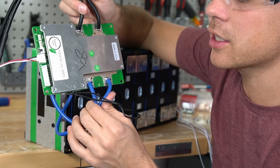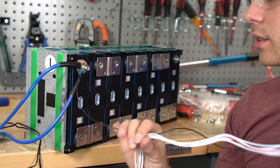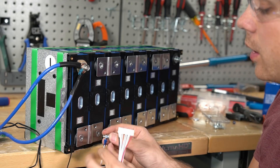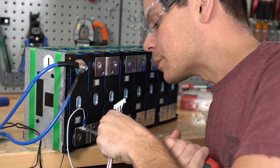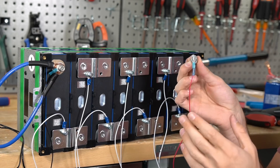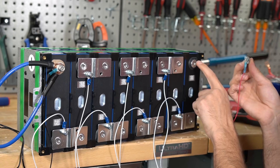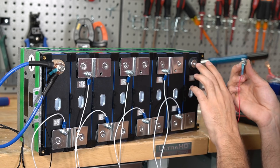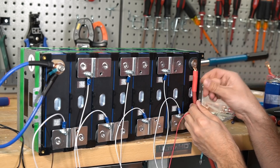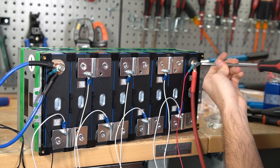It is finally connected. The first connection is made. Now we need to think about where we want to mount this BMS. We could use double-sided tape on this metal, but ensure that the battery connections are not touching the metal, or put it up top — I'll leave that up to you. Most of you will put this into a plastic box and mount the BMS on the side. It's best to not have it touching the cells. Let's attach the rest of these balance leads to the cells — the next wire is first cell positive, so let's attach it.